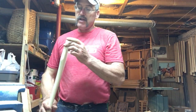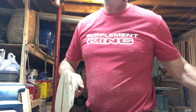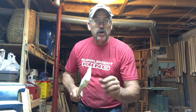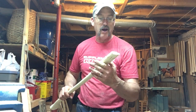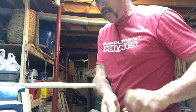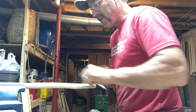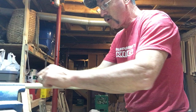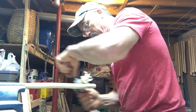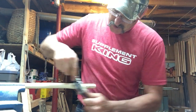I'm not going to take a lot off right here, because I know on the other side this is where I want that head to tip a little bit. I'm going to take it off here to allow it to ride up on this side, which will pull it over. I look at the back — it's dragging a little bit because you can see the curl, and it's definitely dragging into the sides. Now I've done both sides — it's shaped almost identical to my eye. Once your head's on there, you're going to allow the head when it scrapes to show you what you need to take off.